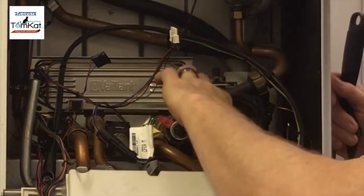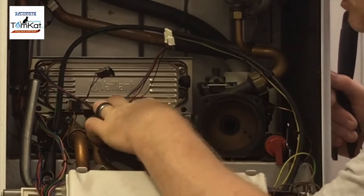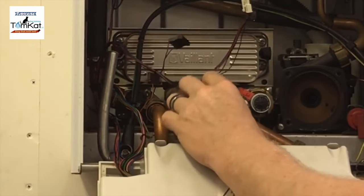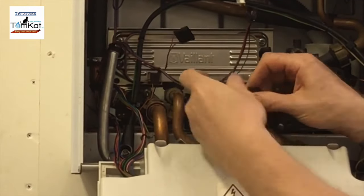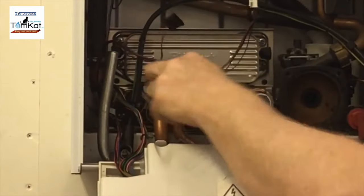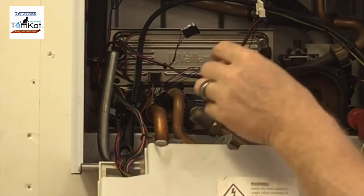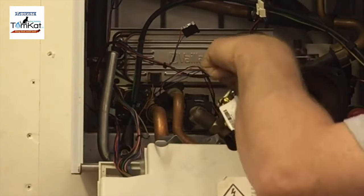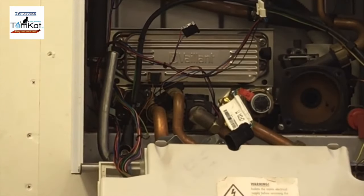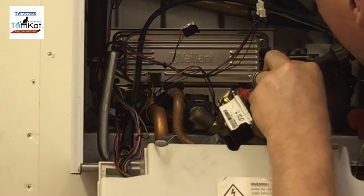Inside here is a washer, which we'll need to change. Now, we're not going to take the pin out yet, so we're going to leave that. I'm going to disconnect the wiring. So that's, again, just your clip, he says. Just undo that clip. I'll explain the difference in these in a bit. So I need to get these three screws out now using a screwdriver. So I'll use the flat one.